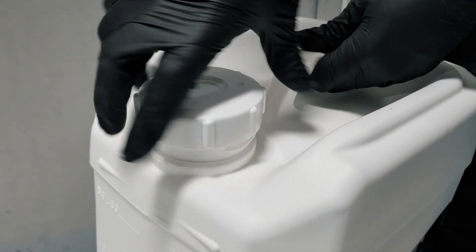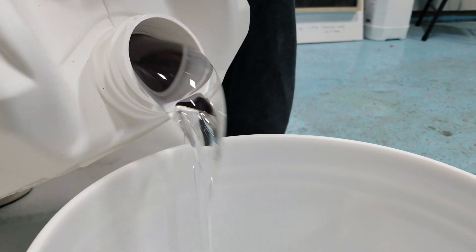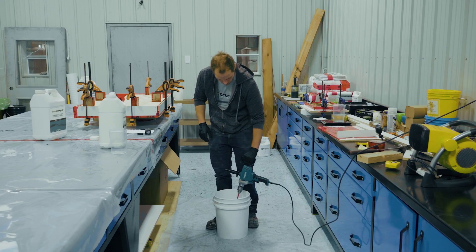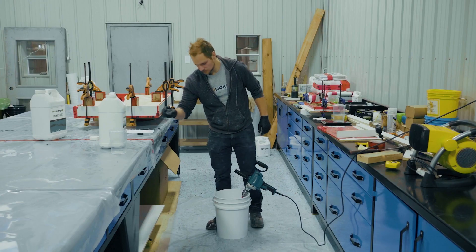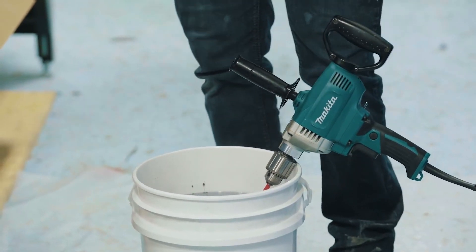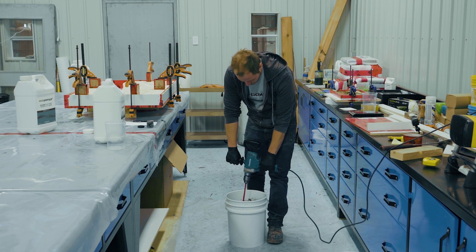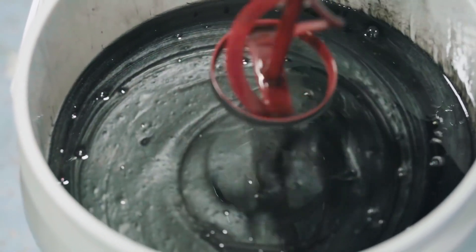It's a 2-to-1 mix ratio by volume for standard pours up to 1.5 inches in depth in a single pour. Always mix the desired amount of resin with exactly half the amount of hardener, and then mix until clear. Now we're going to add the pigment. For this table, we're going to use one of our metallic pigments called caviar. We wanted the table to be opaque, so we're going to add about half of the 15-gram container of pigment. You could also use one of our regular pigments for a solid color, or maybe add polyester glitters, or even add no pigment for a glass-like appearance. Once the epoxy is mixed, let it rest for 15 to 20 minutes — this eliminates most of the air bubbles.